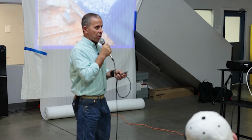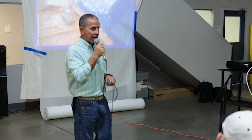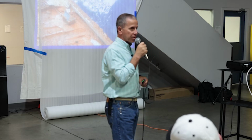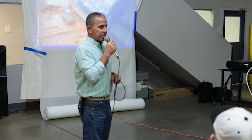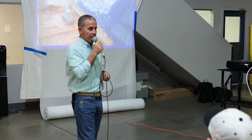Materials that are what we call hygroscopic, that hold water, are sponge-like, and wood or timber is a great example of that. If that's in contact with a painted aluminum structure, that is also problematic because the water can actually penetrate through the paint. If it's a polyurethane paint, those are not designed to be submerged. They're not designed to be wet all the time.